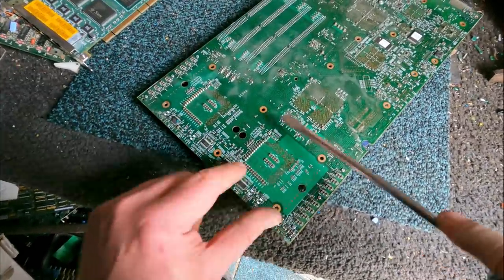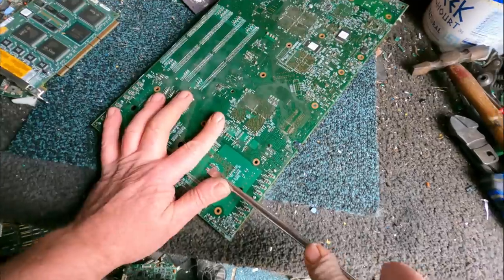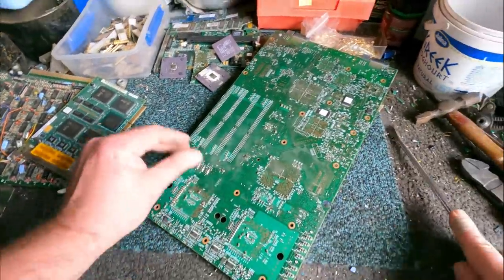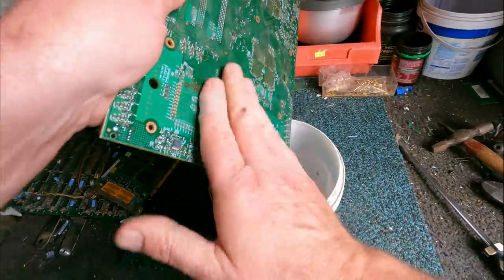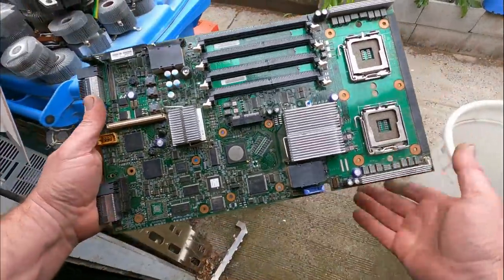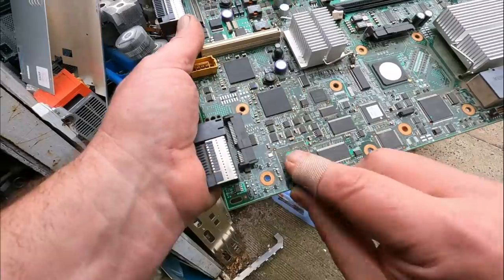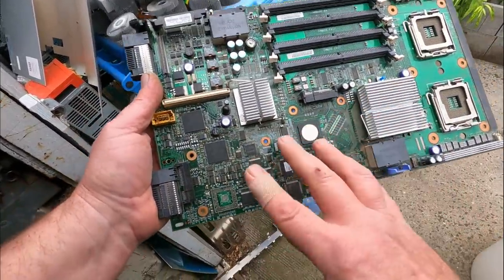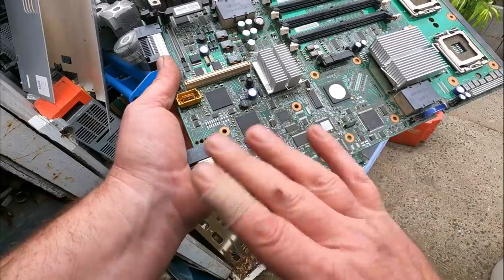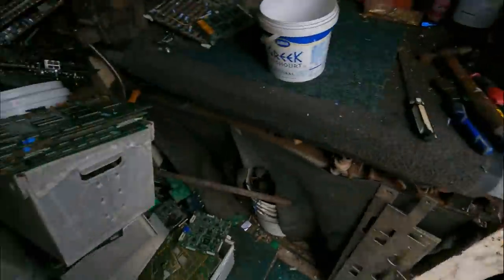You can't notice any difference - we did take a good BGA and we've still got a good server grade motherboard. Your buyer - there's MLCCs again under the CPU, a couple of rows. Just for the hell of it, I'll skim off as many as I can. There we go. There are still a couple of rows this way - I'll leave them. You still want to leave good value. Look at this board - it's just a server motherboard and you don't really notice anything missing. One BGA missing in this case - it's fine, because sometimes there'll be a heat sink on the BGA and the heat sink can get knocked off and the BGA sticks to the heat sink.